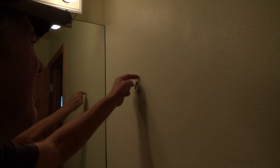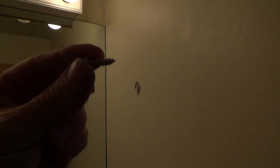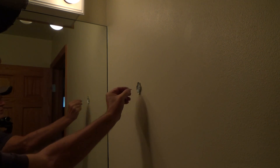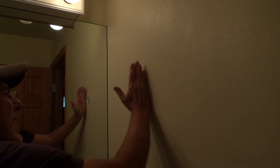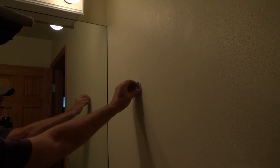This has been painted around several times — I could tap it off with my putty knife — but if I don't have plastic anchors I don't want to do that. These screws are only this long, and the drywall is at least a half inch thick. Even if there was backing wood between two 2x4s, these screws would never reach it. I could try a longer screw to see if there's wood behind there, but chances are there isn't. I think the stud is about here — so I'm going to decide not to take that off unless I can find the plastic anchors.